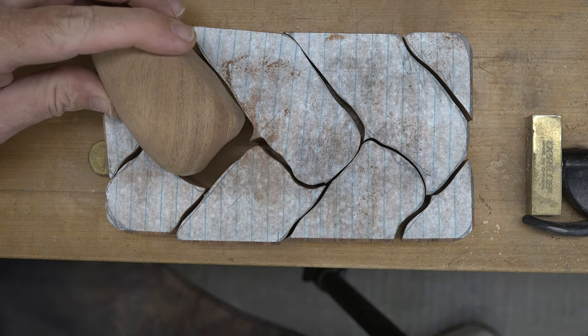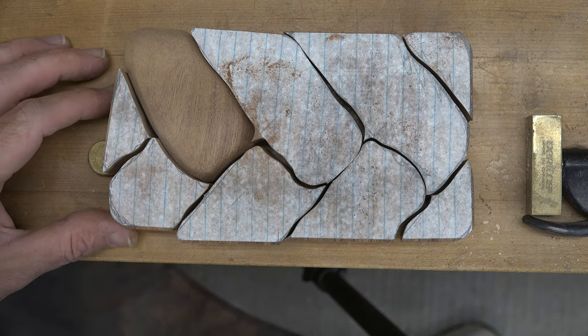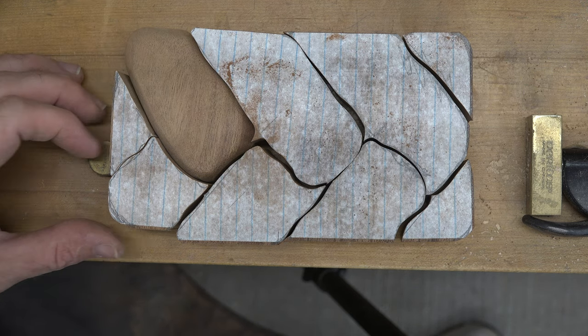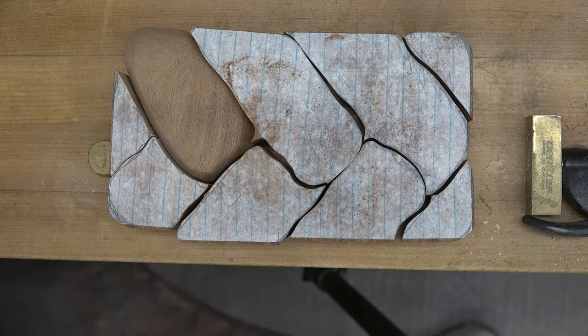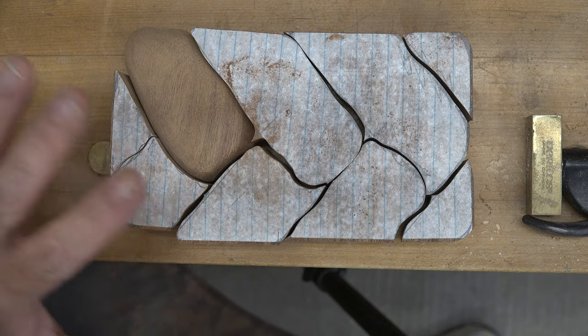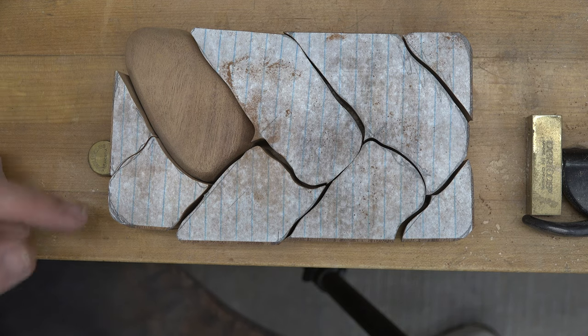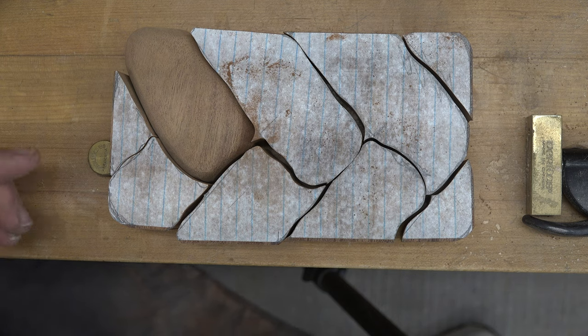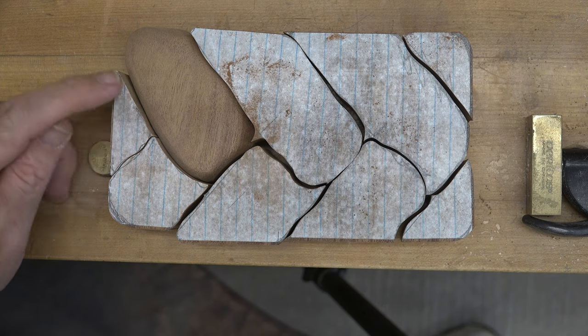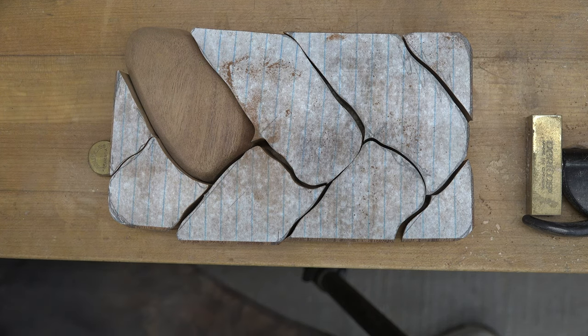So what I've done with the belt sander is I have carefully rounded over our edges, just like that, to give it that three-dimensional kind of a bun look. And that is how we're going to approach every single piece. So I'm going to shape them one at a time here, and then once I get them all roughly shaped, we can make slight adjustments by hand sanding or sanding on the oscillating drum or even a palm sander. But for now, I need to get all of these top corners all rounded off so that things blend together.